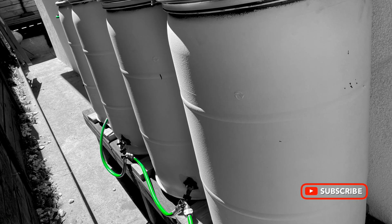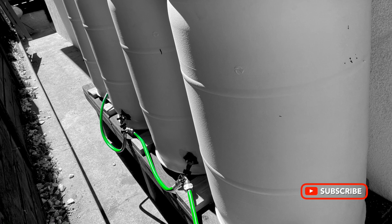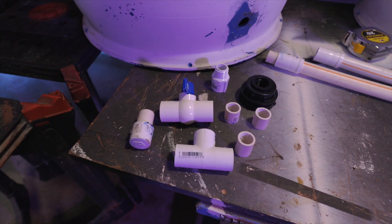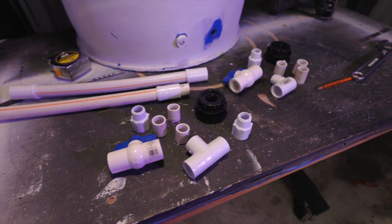This was my first setup. These green hoses didn't work out too well. The shutoff valves got corroded and they snapped off when I would try to use them. So I took everything apart and bought all this junk at Home Depot — pipes, shutoff valves, some flex pipe just in case of an earthquake so things can move around a little bit.